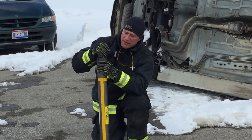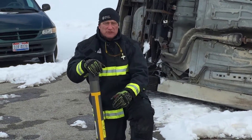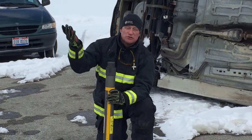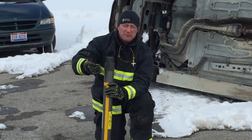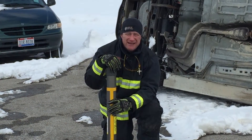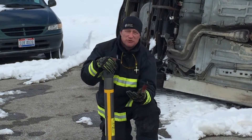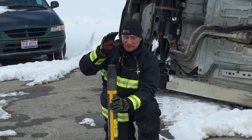So these are radically stronger. In level one applications, that's not a big deal because all of these loads are very manageable. But when we start talking about supporting level two vehicles — cement mixers, dump trucks, tractor trailers — the number of struts you apply scales directly to the load. If I have a 20,000-pound load and I'm using one point as a pivot, I'm assuming a 10,000-pound load. If my struts can only support 4,000 pounds, I need at least three struts. With a Paratek strut, you can potentially use a single strut because it's designed to support that much more load capacity.